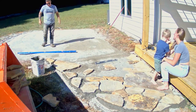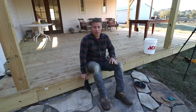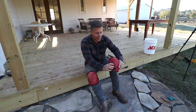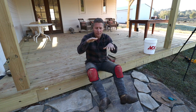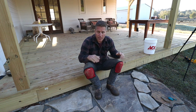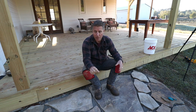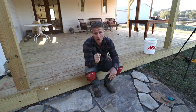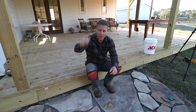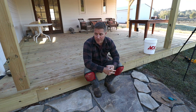At this point it definitely became a tedious job, but also kind of fun because the flagstones after a little bit of tinkering always seemed to find a good home. We're on the second working day and it's going pretty smooth. There's a lot more variation in the thickness of the flagstone than I was thinking, so keeping them level has been a little tricky. I'm using about a half inch of mortar mix material under the stone. I did not rent a saw — the hammer is actually working pretty good. Use the claw part of the hammer, chip it a little bit, then flip it over and just break it off. Some edges to get them to fit perfectly just knock right off. No saw needed.